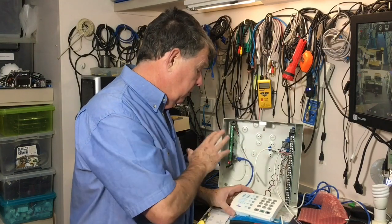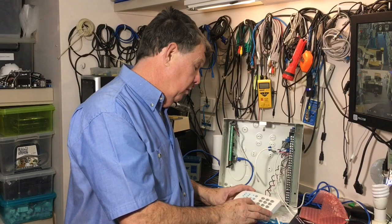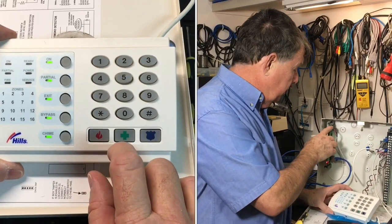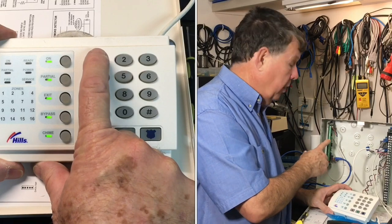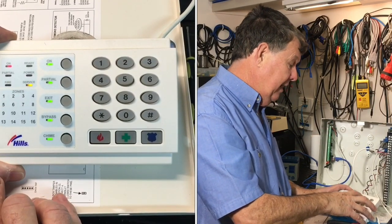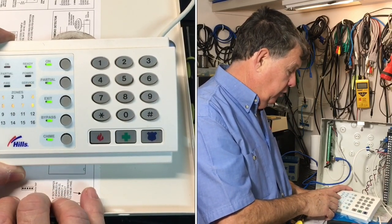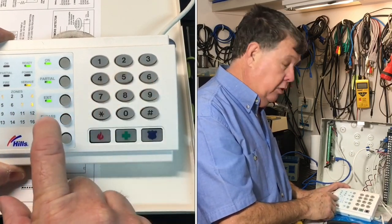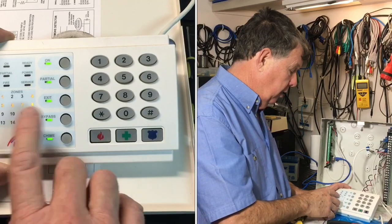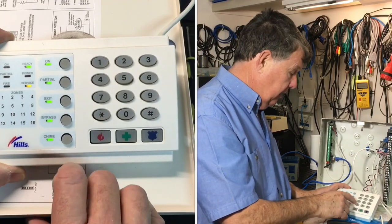So we've got the CONNAV card connected to the Ethernet. Going into program mode is quite simple — press Star 8, then the program code (in this case 9713 on this panel). This device is number 191, so type 191 hash. We are now connected to this card. Go to feature 19 by pressing 19 hash. When the card is first powered up, options 5 and 6 won't be turned on — turn them on by pressing 5 and 6. In feature 19, we want to see lights 1, 4, 5, 6, 7, and 8 on. Hit Star, Star again to come back out.